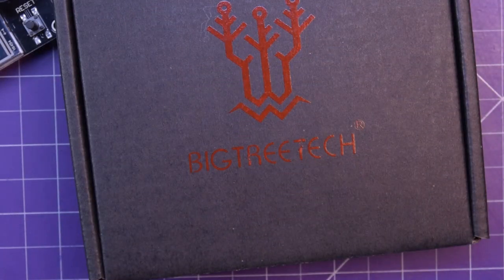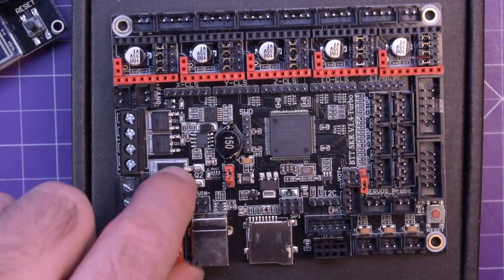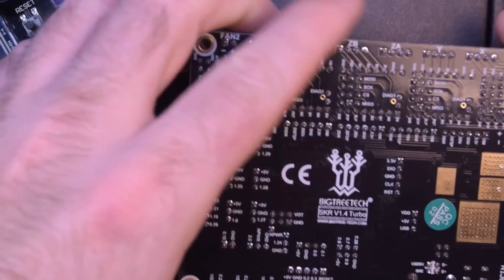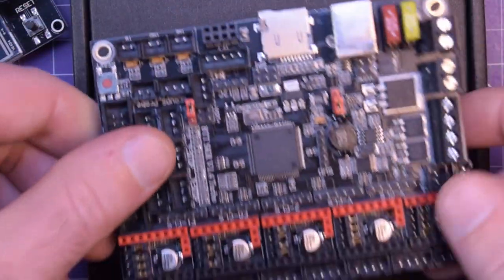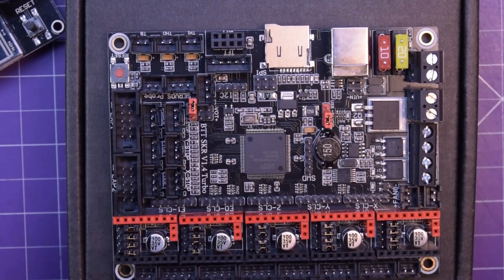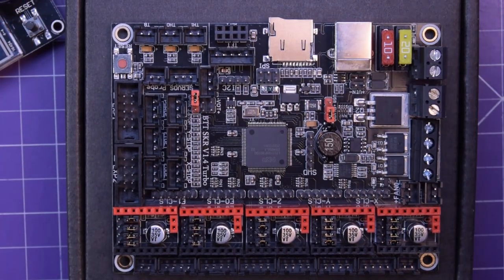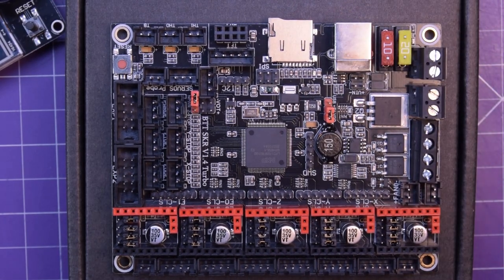It's got some fairly big MOSFETs on here — WSK 22-0-N04. This guy's probably a high current draw here, and then there's two on the sides which are probably lower current, WSF 3085s. The only thing I'm not sure about is if this will actually run on 24 volts — I need to make sure because if not, we are running at 12 volts which is not ideal. I might just go 24 volt and have the heating elements run at 24 through one of those little MOSFETs. This is all up for decisions later. The most important part right now was to get the parts so that when I'm ready to go, I've got them.